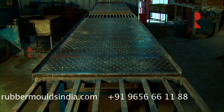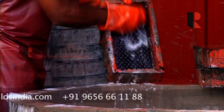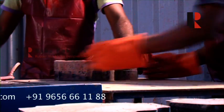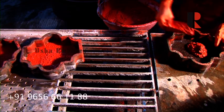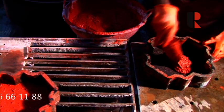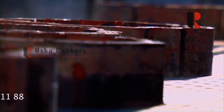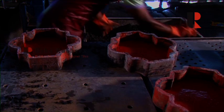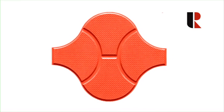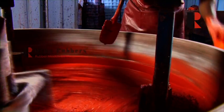The vibrating table is switched on and the clean molds are placed on the first vibrating table. The molds are filled with about 10mm of the first mix using a measuring cup. The molds are then allowed to vibrate and move towards the second table on their own. The quality finishing of the tile greatly depends on the quality of the first mix.